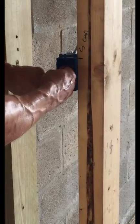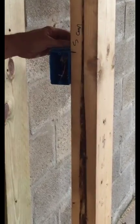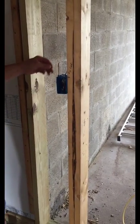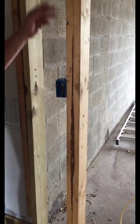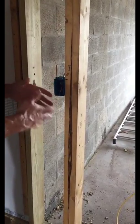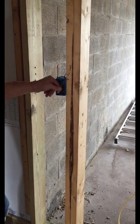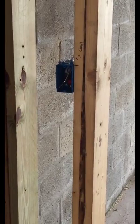Twist them together so it's nice and neat and push it to the wall. In this case we have a junction here — power comes in, power goes back out — we took care of that by wire nutting everything together. You have one end of that power feeding into the light. All the neutrals are tied together, and you just have these three wires: a few black wires and a ground wire. That is it.